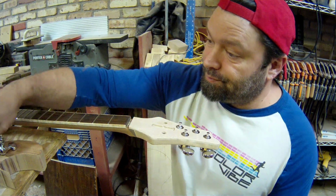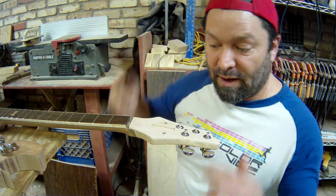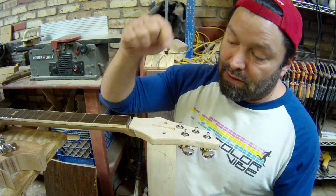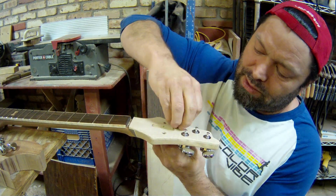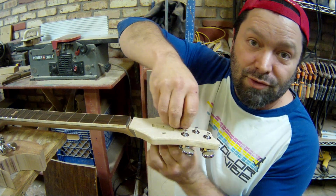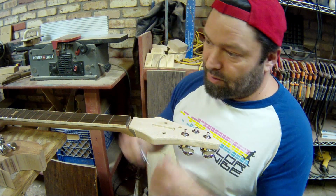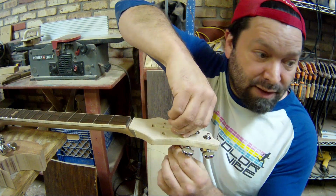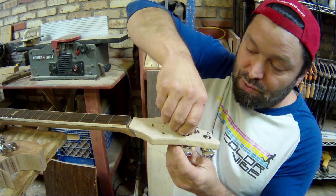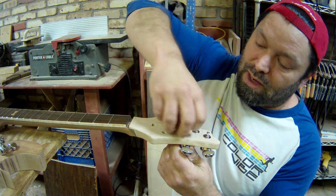So, I'm left taking this guy and working down that side, whichever side is the tight one. Just open it up enough that we can get the bushing in there. And usually, like this time, it's a small enough amount that it still looks like a circle. Even though you worked it down just a little bit, you can't really tell by looking. Still, it's another one of those things where it doesn't matter, but it matters to me. I'm shooting for a certain level of precision, and when you fail to meet that for whatever reason, it's just annoying.